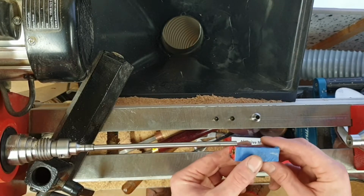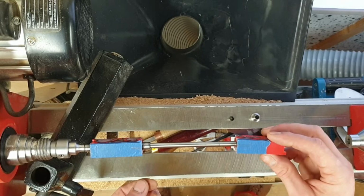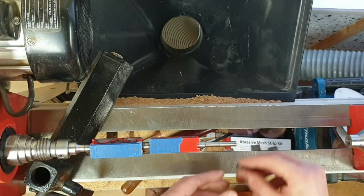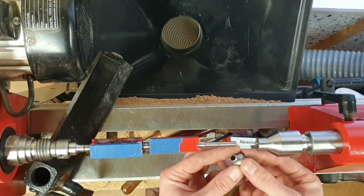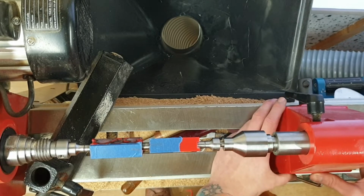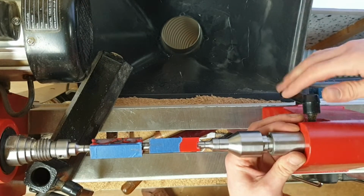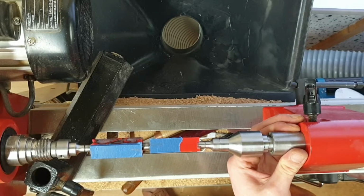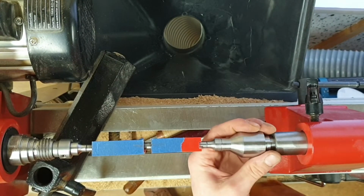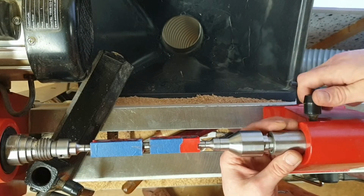That bushing then slides up to that one, so then your work piece actually goes on another bushing, so that's the second bushing, then your second blank with them lined up, third bushing, and then you bring the tailstock up, place that one in the end, slide that up, and then the tailstock, there we go, that's nice, lock it off, and then all we need to do is just pinch it up so it's not overly tight. There we go, they feel nice and tight. In fact we'll do them just a touch more, but you don't want to put any more pressure on really than necessary, because you can bend the mandrel. So we'll tighten that up there now.